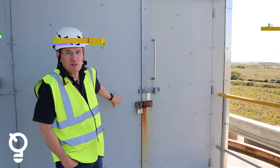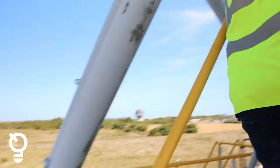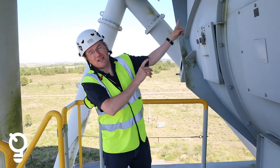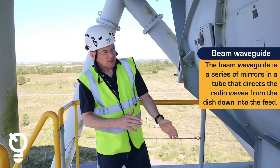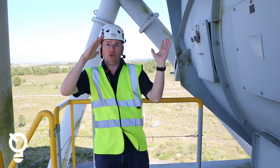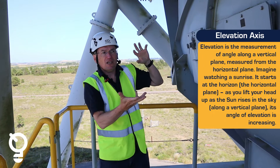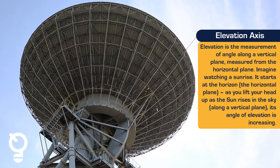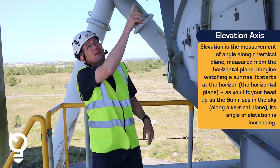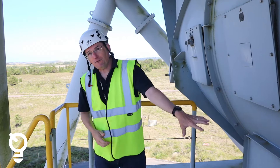This is our azimuth cabin. The cable banding arrangement in here is the part that allows the cables to turn with the antenna. This arrangement of tubing that goes up the back of the antenna is called our beam waveguide. The signal is launched from the feed at the bottom and reflected via a series of mirrors — two mirrors down here and two more up on the elevation axis — allowing the antenna system to articulate around the feed and bottom mirror, so the signal always points out through the middle of the antenna, with the feed fixed down at the bottom.